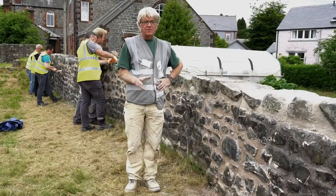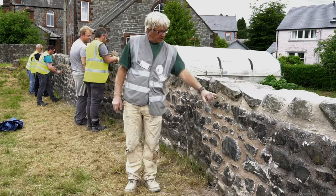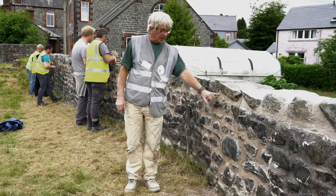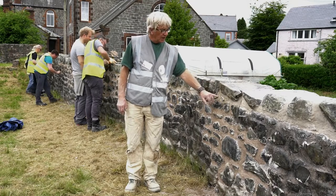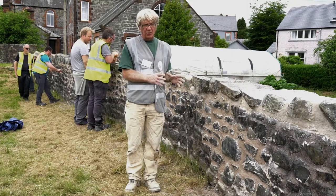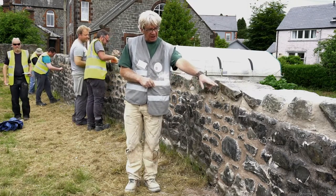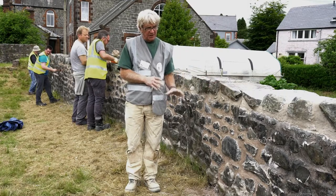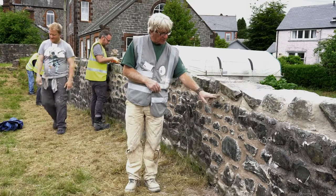So lastly, just focusing in on some of the finer detail here, this mortar has just gone in. This is the pozzolanic mortar, so it's moving to stiffness pretty quickly. This is off the tool and polished, and that's not how we would leave it normally. You can see here some has already been taken back that was done yesterday or the day before. And this area, which is the more normal mortar, this process has already happened.